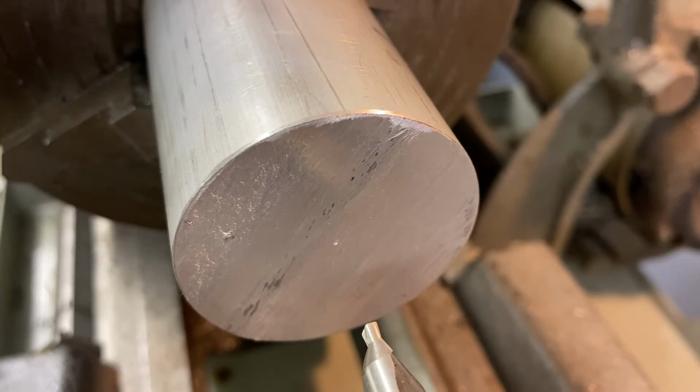I will then lock my tailstock down with a wrench, make sure that it's securely in place, turn my headstock by hand to make sure that it's freely moving and nothing's locked in place, turn the metal lathe on, and slowly advance the tailstock's chuck with its handle. That first couple millimeters is smaller than the rest of the center drill. It tapers slightly, then it goes straight, and then it tapers again, and then it goes straight again.